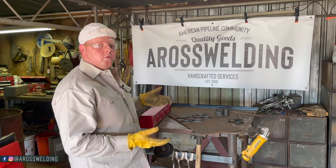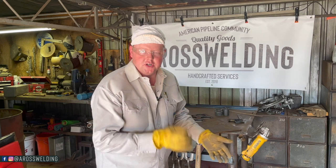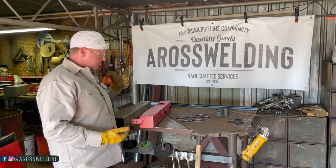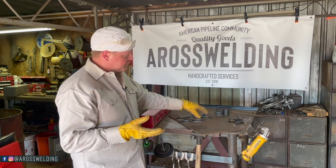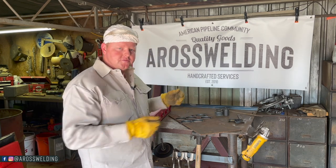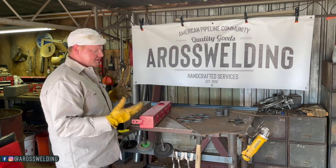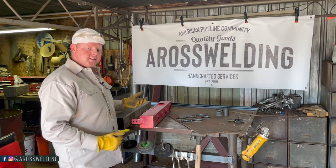That way, plates can be cooling off. This is just a habit that I've kind of created over the years. Technically, depending on what you're building, you could cut something with a torch and have a bucket of water close and dunk it in the water. I've known people to do that in the past on certain projects. I've done that in the past on certain projects. Still do. I got a bucket of water over here. But from what I've heard from my elders and school teachers over the years, that actually can crystallize the metal, or if you're doing it to a weld, if you just weld something and you want to cool it off quick, that can potentially crystallize the weld, or does crystallize it, makes it weaker. So all this to say, it's a good practice to let metal cool off first versus dunking it in water.